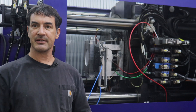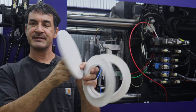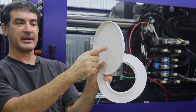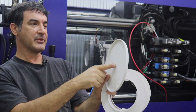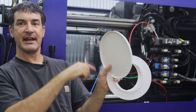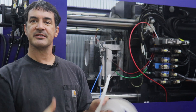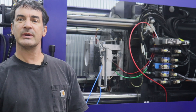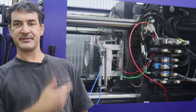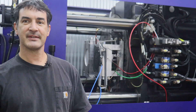We'll use the injection unit itself with a sprueless injection - the injection unit of the molding machine will come right up to the cavity that creates this disc and inject with a little bit of a remnant on the back. We'll also talk about pneumatically activated A-side ejectors, which are basically air cylinders machined into the mold block itself. Stay tuned - there will probably be several episodes on this series.